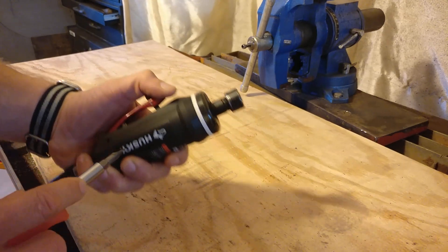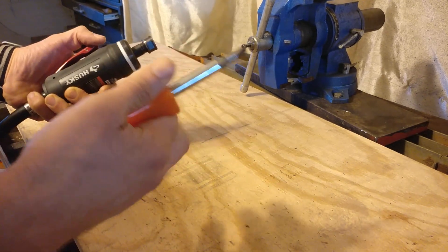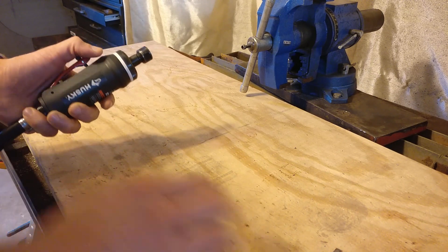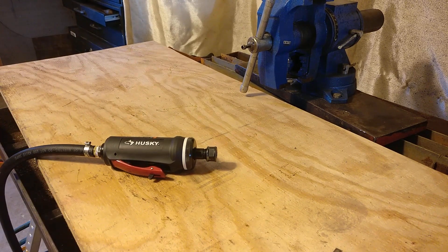Underneath the lever, there's a little brass valve. When you hit that down, air flows and the tool chooches — more air, more chooch. So there's a screw you can turn, adjust it higher or lower, and change the maximum RPM of the tool. And this was on all of his die grinders, including the cheap Harbor Freight one.